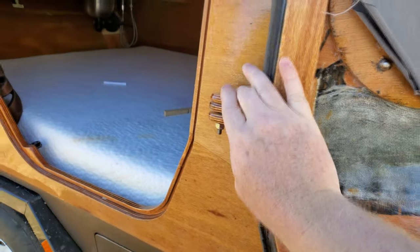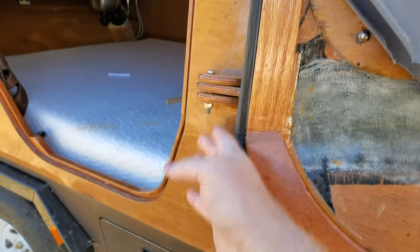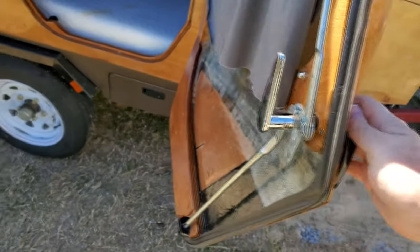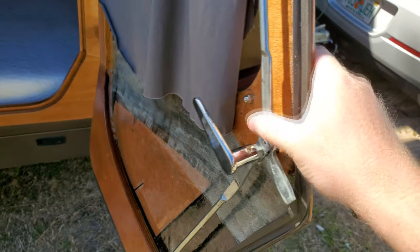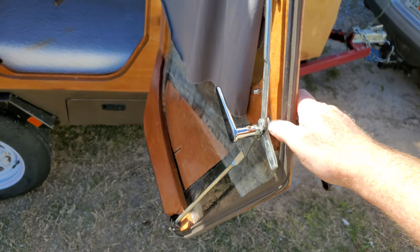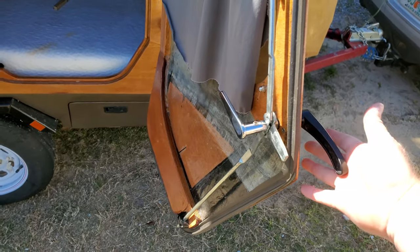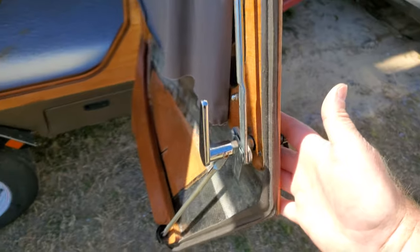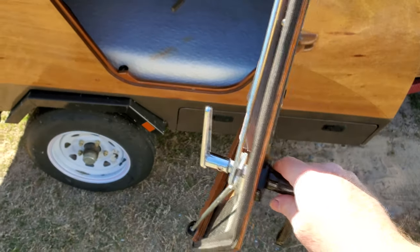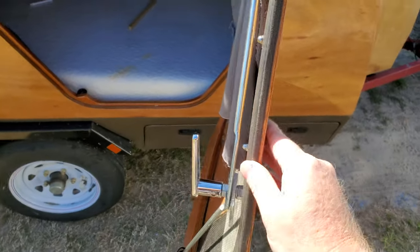The bolts they used were really tiny — I obviously upgraded my size and bolts. The other issue is the door mechanisms: they have lots and lots of play, and they don't fit correctly. I understand a lot of the stuff is off-the-shelf parts. I have some video I'll chop in here showing how to add a three or six millimeter shim in here to make it all work perfectly — though I tried to take that video in the rain.